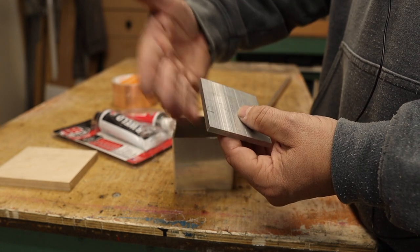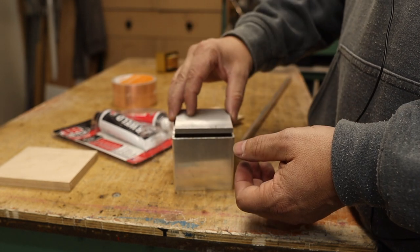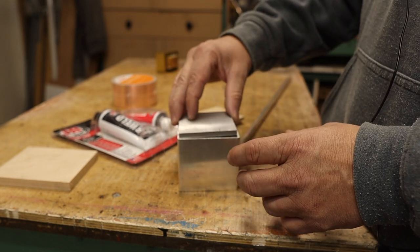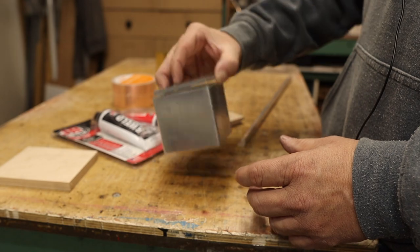And with the metal here, cut it all to trim to fit nicely. And what I do is I'd bevel all four corners and then I can do a press fit in there. And you probably wouldn't even need any JB Weld, but I'd probably put some just in case. And once that's all set up, you can paint that as well.